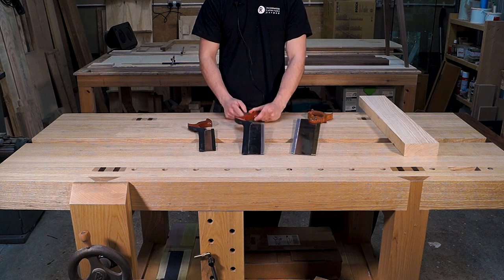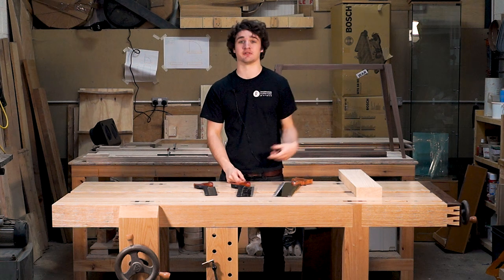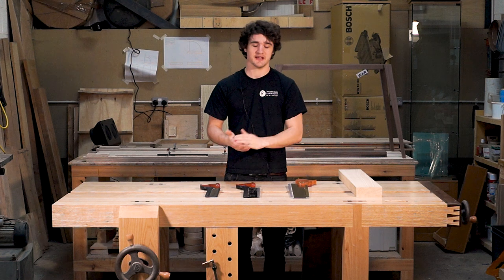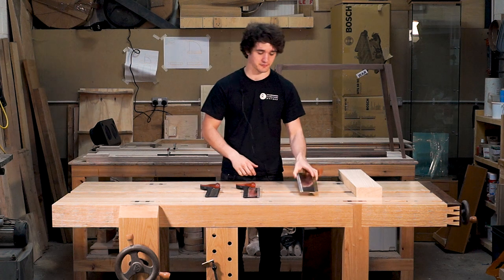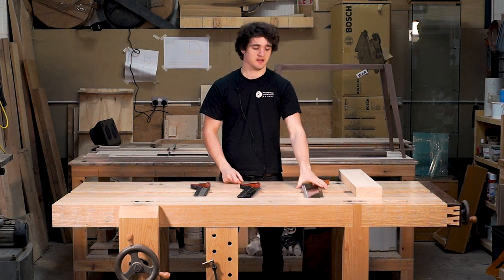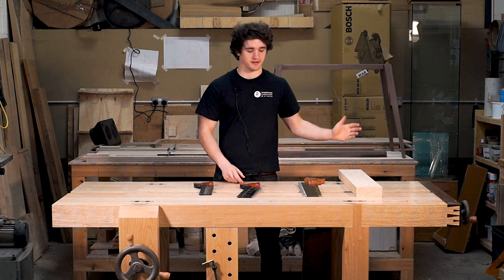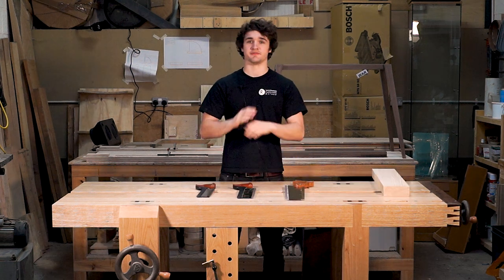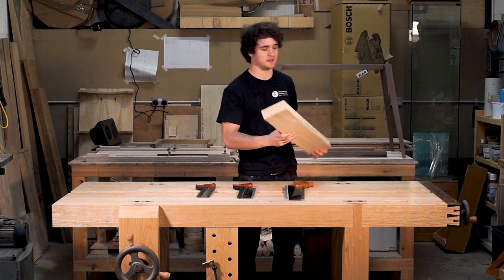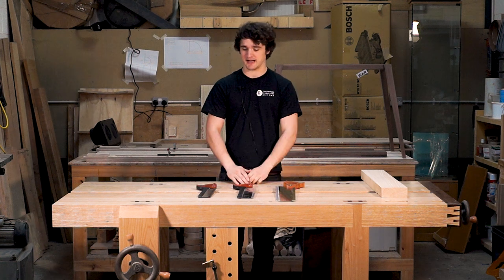So there we go — that's pretty much all I have to say on the subject of saws. Hopefully I've clarified the issue rather than given you even more to think about. You really just need to look at your current setup and what you need in terms of hand saws. If you've got a bandsaw, a dovetail saw and a cross cut carcass saw should be fine. If you don't have a bandsaw, get a tenon saw and a dovetail saw both in rip cut. If you want three saws to cover all tasks, get a rip dovetail saw, a cross cut carcass saw, and a rip tenon saw. I've never found a need for anything else in my setup. Leave your opinions in the comments and see you in the next video.